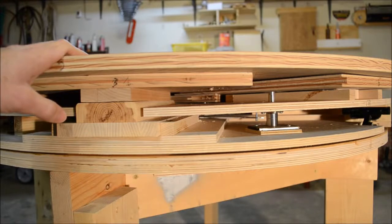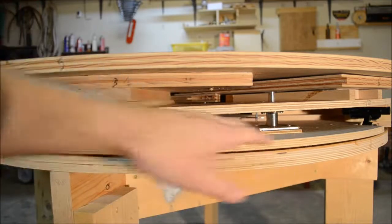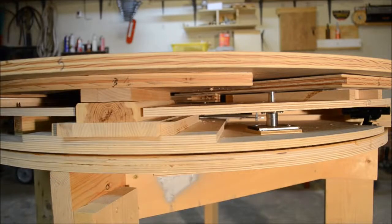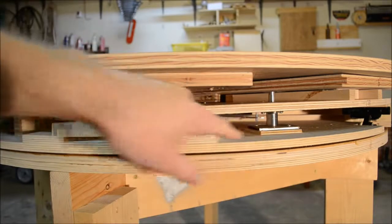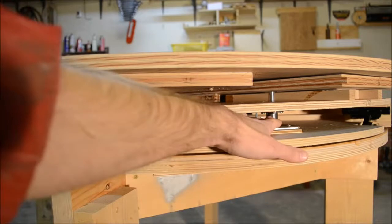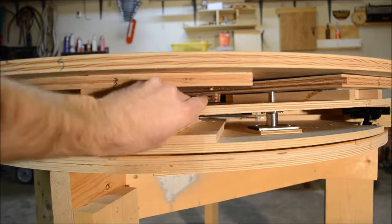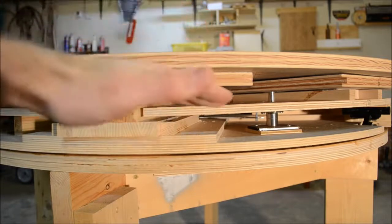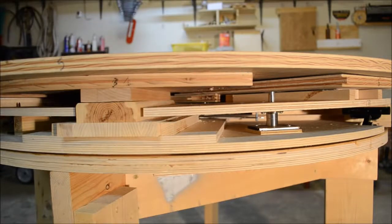This piece is a linear bearing. The way that works is that a hardened shaft sticking up is welded to a flange, which is then attached to this lower level. The fatter piece here is the bearing which rides on that hardened shaft, and that keeps this lifting level properly aligned in X and Y, but it can go up and down as it needs to.